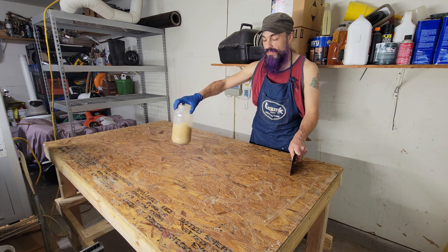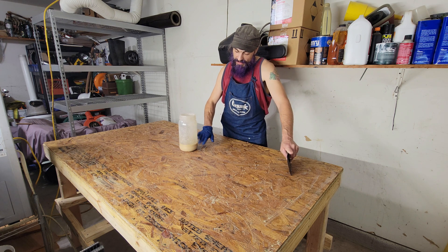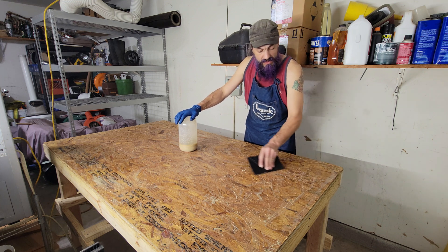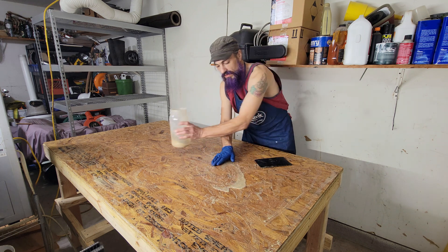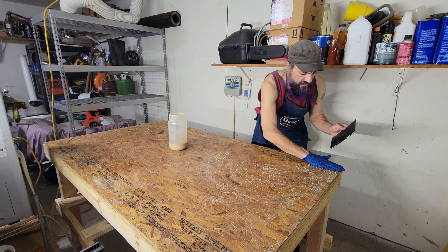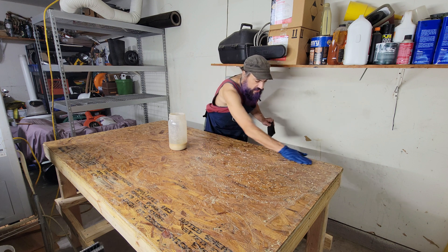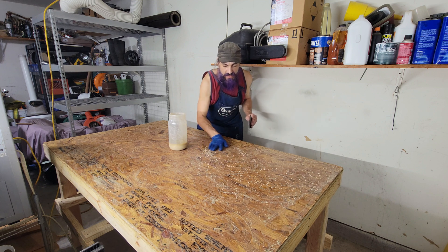This is the purpose of the video — a concoction I've come up with. I have used the liquid without the additive before, and it is water glass. Water glass is sodium silicate; it's essentially silica in a solution. Sodium silicate has a very long history of being used for a variety of things in agriculture. It's used in some barns traditionally, where they spray the wood, because the end result is a coating of essentially silica glass that will make the wood rot resistant, fire resistant, mold resistant — all kinds of things. And it makes the wood harder.